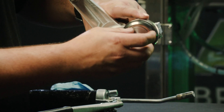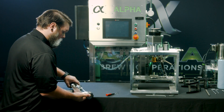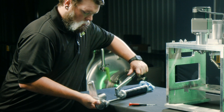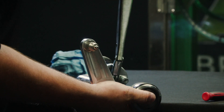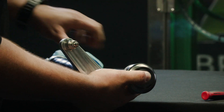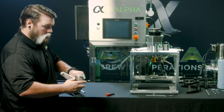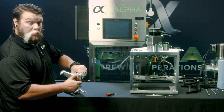Then, while holding the center cap in, grease the fitting on top of the roller until you feel grease pushing against the center cap. Once this occurs, roll the grease into the bearings. You shouldn't get more than two revolutions out of the roller once it's properly packed.